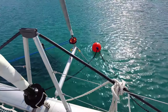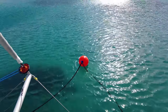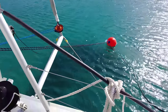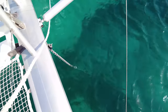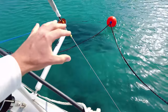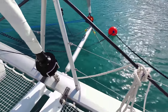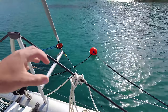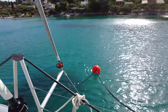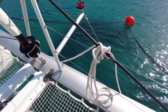Another trick: you never know if these buoys break, and there's no guarantee - if the buoy breaks in strong wind you're gonna be out to sea in a couple of minutes while sleeping. We're here in around four meters of water, and I just dropped the anchor about 10 meters - just enough so that if the buoy breaks it's gonna start making noises, wake me up, and hold the boat a little bit so it's not so fast onto the rocks.